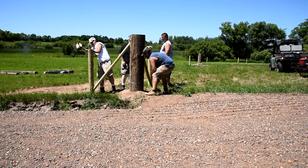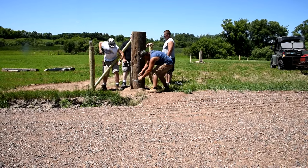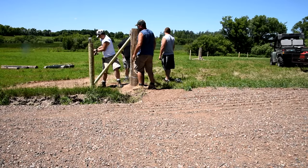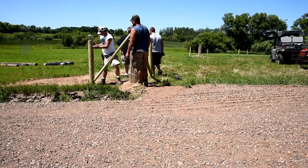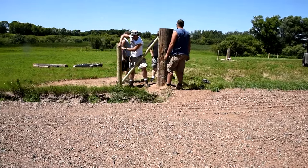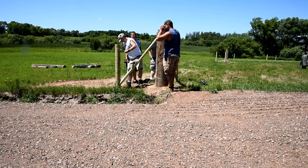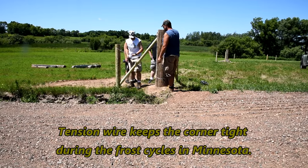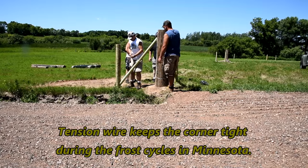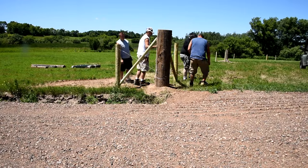This is basically a team effort. It took us about three and a half hours the day before to drive in all the wood posts, then about two hours to do all the corners with a team of four guys on each farm. Each corner is made up of two braces, three posts, and a tension band wire twisted tight which gives it its strength. Once we got done with this, it was on to the design — where the gates would be — and that was really the fun part of the project, stepping it off by feet and pulling out the tape measure.